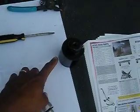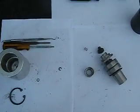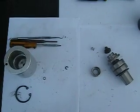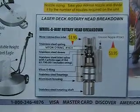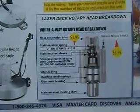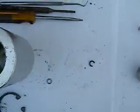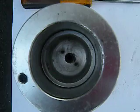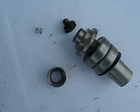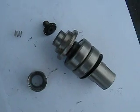I have, as you can see, another one, and I have about 4 of these BE swivels that have failed on me within the last 30 hours. I'm thinking it's because the heater which I operate is outside the specs of the manufacturer. I think it's up to 180 degrees, 7 gallons a minute or so, 8 gallons a minute I believe. And sometimes when I crank it up to 225, I guess you just have a little too much heat. It could also be attributed to the amount of impurities in the water supply, calcium, etc. Especially when you shut down the swivel for any length of time in between uses, and the deposits start to harden on the mechanical face.